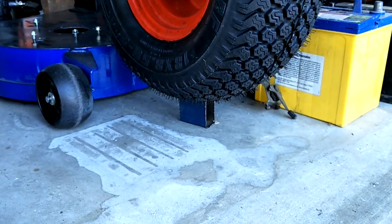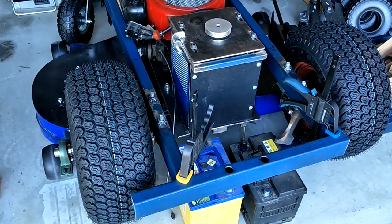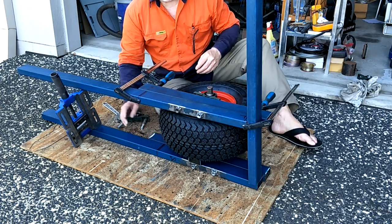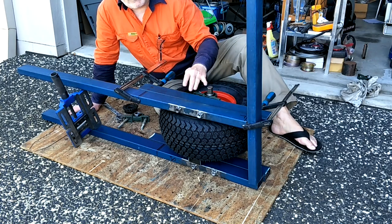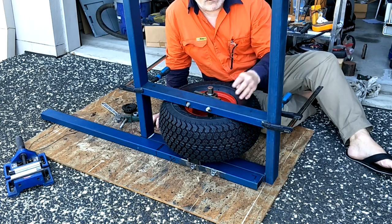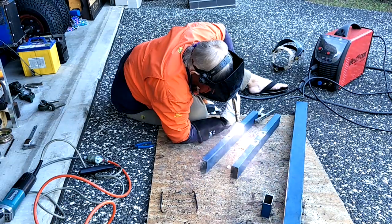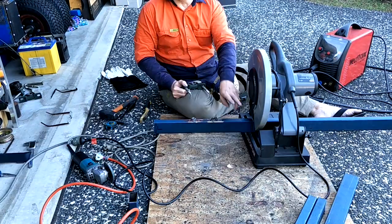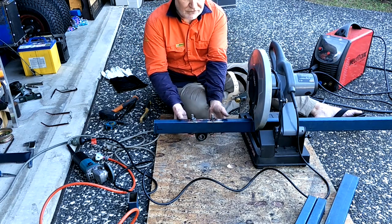Lying in bed last night I was trying to work out how I'm going to address this issue of trying to get the frame up and the wheel down. I've got a couple of different ideas — if you can imagine this is chopped through here, you've got two short pieces and another piece here that's basically the outside wheel frame. It's going to be joined from side to side at the top, and the 65mm piece here basically lifts the frame up. The other option is to do away with this top bar completely and just have the support bar 65mm lower, so the frame sits 65mm lower — that's probably the option I'll be taking. This inside rail is now going to become an outside rail because I've got the nuts already welded on, and the bolts I've got to go in here are just big enough to go through 65mm, no more.